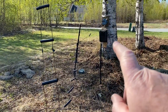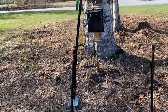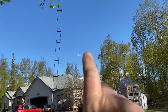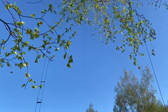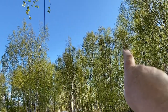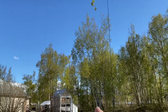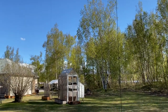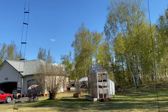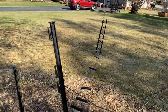We've got an MFJ tuner at 50 ohms and the V-beam — which you won't be able to see — but it goes open wire up about 60 feet through the trees. One leg goes down to that tree and another one goes to that tree. The internal angle between the two wires is about 54 degrees and it's beaming 034 degrees through, over the mountains you can see on the far side, which is not a good direction. It's far to the west of where it needs to be, but it's just testing. Using open wire feeder, approximately 500 to 600 ohms.